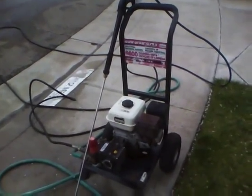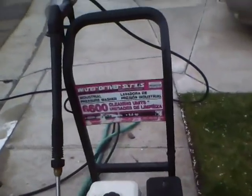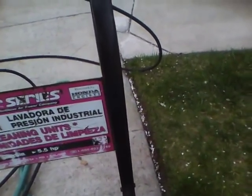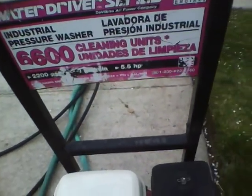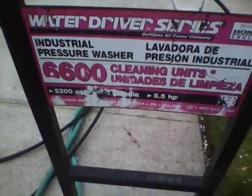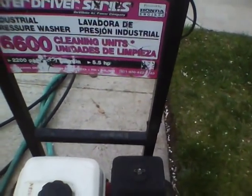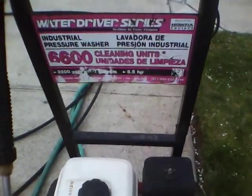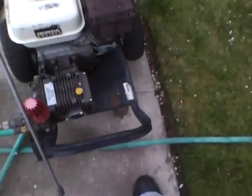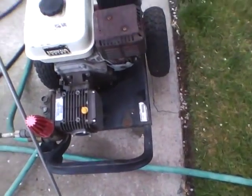This video is for one of my three pressure washers. This is a Water Driver series by DeVilbiss Air Power Company, powered by Honda engines, industrial pressure washer, 6600 cleaning units. Original pump was 2200 PSI, but we had to replace it because my dad loaned it to someone and he ran it at a KFC with their hot water system and fried the pump. So now it's got, I think, about 3500 PSI, running on a 5.5 horse engine.